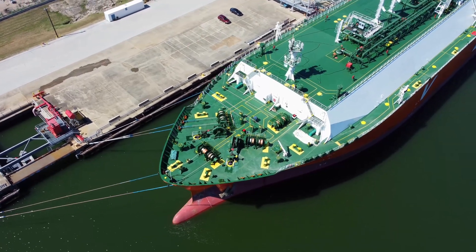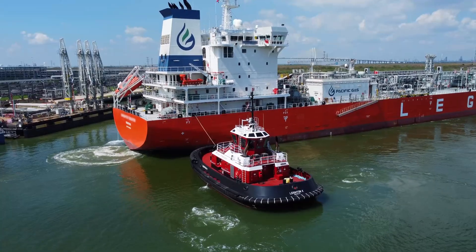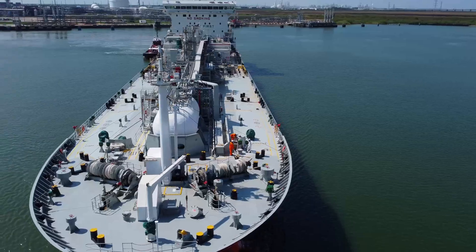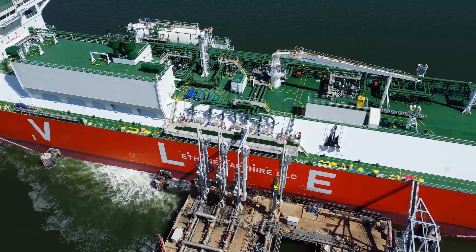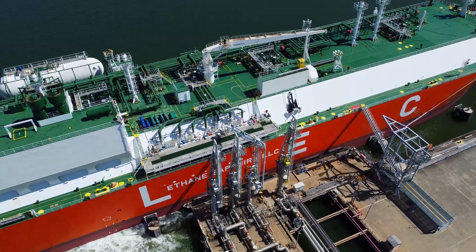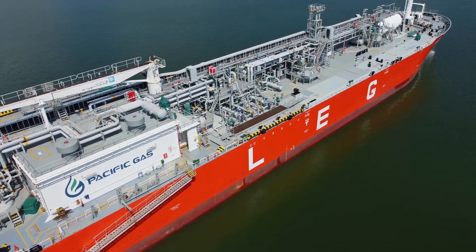Short-deck wharfs offer deck space only at certain areas of the ship where work needs to be done while the ship is docked. This wharf type can most often be seen at tanker terminals. Tankers are loaded or unloaded via pipes that are connected somewhere in the middle of the ship, so very limited space is needed for pipe support and connections.